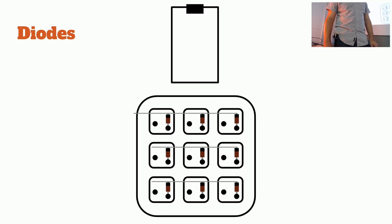Oh, does the info JSON actually have the circuit info? Not the info. I thought it was just the layout. There's a layout JSON that you can use to import into kbfirmware.com. And then build your firmware that way. And it generates the hex file and all the source files for you. To record a macro, it has a record feature that you can just do the macro. And it's way easier for doing macros, which is what I use these for. It's way easier than QMK configurator. QMK configurator, to the best of my knowledge, doesn't have that record facility that KB firmware does.